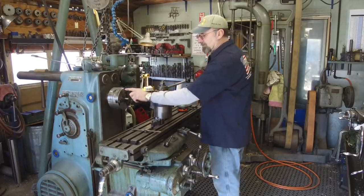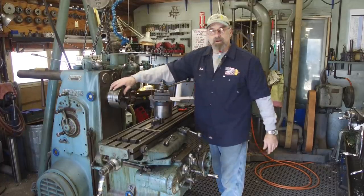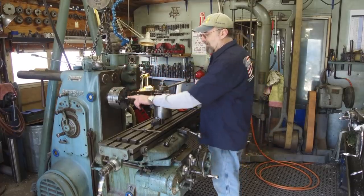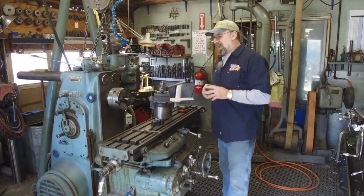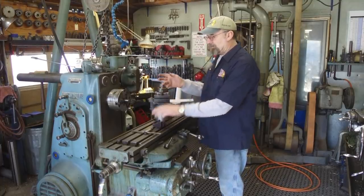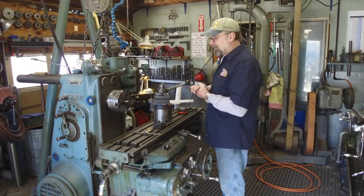And I'll probably take some Delrin diameter rounds and put them in there, just so that those are not pockets for stuff to get caught in. All right, I've put a half-inch dowel pin in the 3-jaw. I brought these over here, and I want to pull those jaws apart and clean it because I haven't cleaned that chuck in a while.